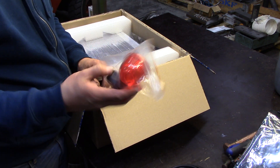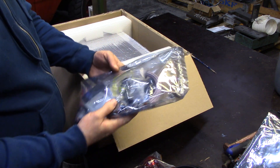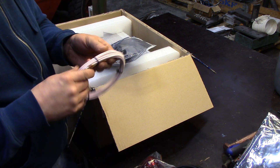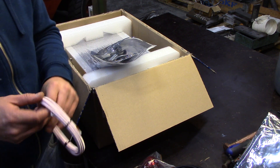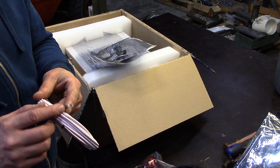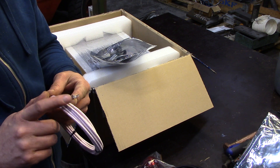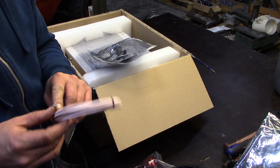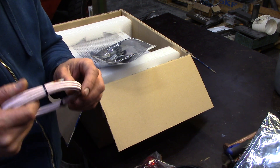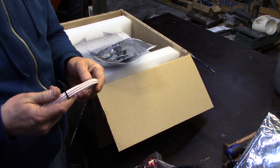I also got a nice little warning light. And in here we have the litz wire — this can get expensive real fast if you just want a couple of meters. Mike was very generous and offered to join the lug ends to the cable because he has a soldering pot. Generally you can't do litz wire with just a normal soldering iron — it's not powerful enough. Both ends are tinned, so this is perfect, very slick looking cable.